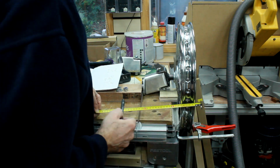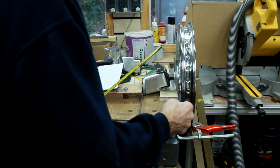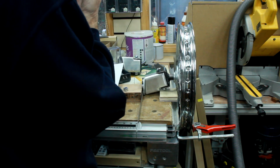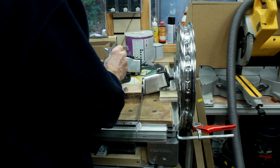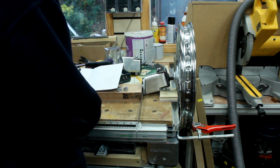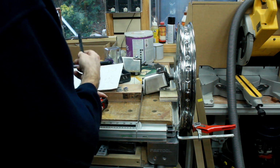That's 225mm. It gives me the centre of the track to that same position, which is 175mm, so I can work backwards from the known requirements of the Cyclekart for track width, overall cart width and all that sort of thing. And so that means I can now get this front axle itself sorted, which will open up getting the whole of the front end into a state where it's finished and rolling around on the chassis.